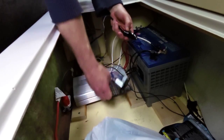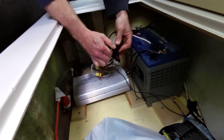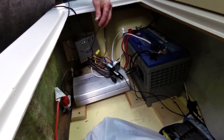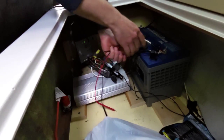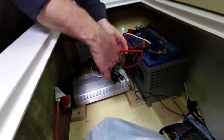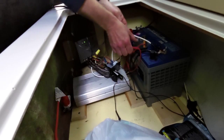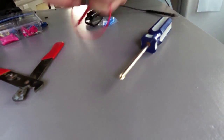This is the step I put on — I put the 12 volt DC adapter in the plug here, and now I'm going to find out if we've got the polarity correct. I've got this set to volts. It should be positive in the center, negative on the outside — and we are good. 12.83 volts, so that is perfect. I can plug this into the incubator and see how it goes.